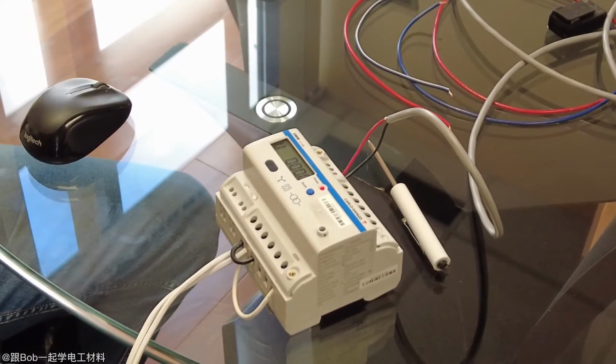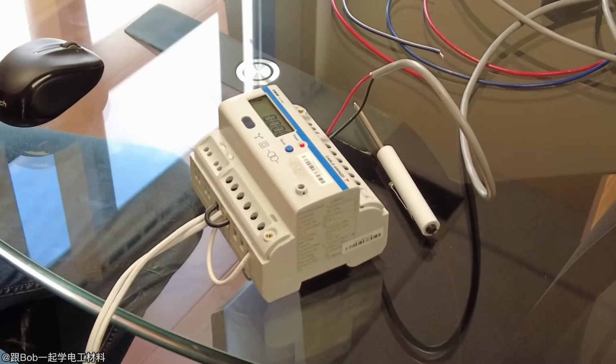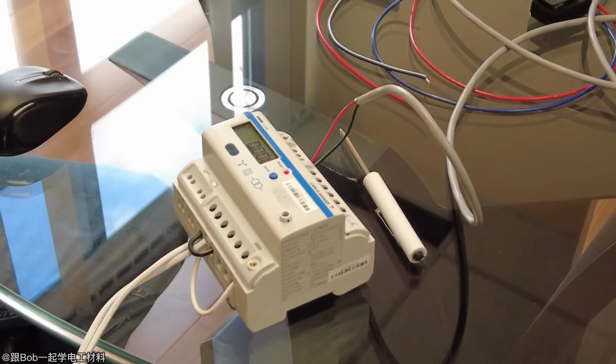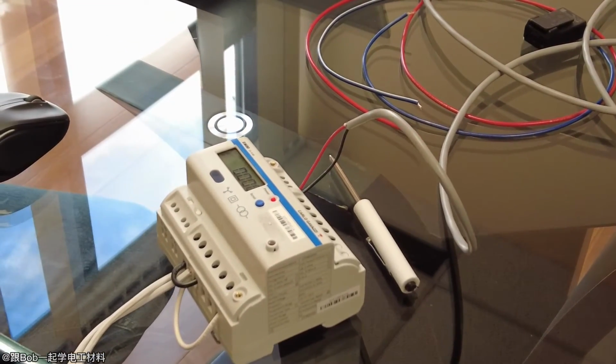That one is a different CT, yeah. That one won't be compatible with the 80 milliamp CT. If you put that in, the current would be too low. You wouldn't get a proper reading. So if you have someone that needs a meter, you can sell them the other.